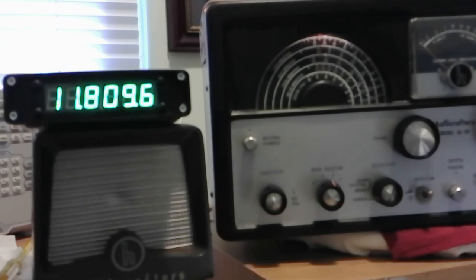Oh, properly seated, no hum. It was intermittent. Turn it upside down or sideways, you'd get the hum. Sometimes you could knock it with your hand, the hum would go away, and it was just simply an unseated tube. Lesson learned, put the tubes in firmly.